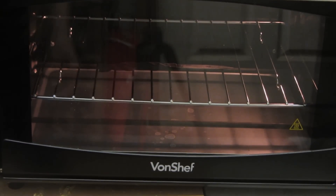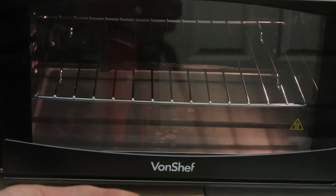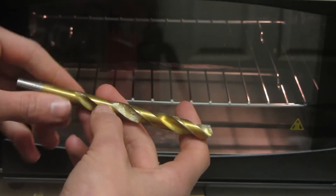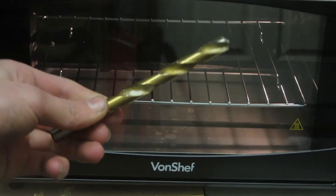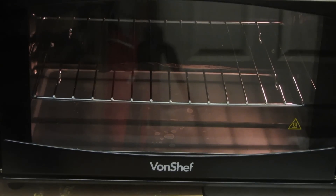While thinking of handle ideas, I considered drilling into wood and gluing it on, or doing handle wrap. But because these drill bits have nice grooves in the shank, I decided to melt HDPE plastic recycled from old bottle lids — this will create a really interesting handle that I don't think anyone's really done before. While the knife tempers in the oven, I'm going to make a mould to press the HDPE in and around the handle.